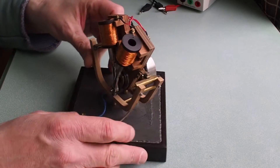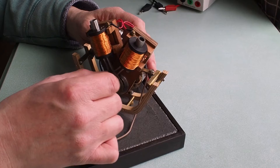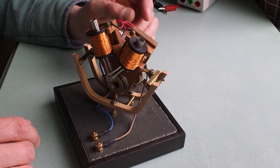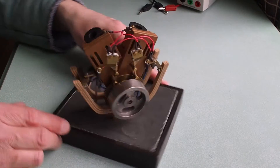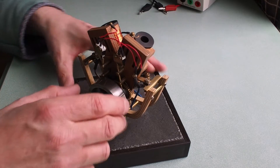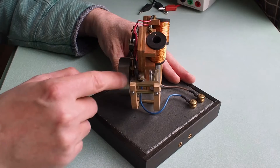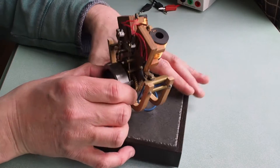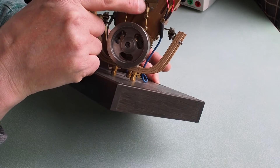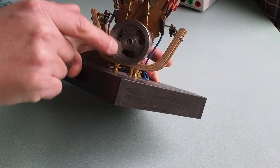With the single pin, what we get is a firing of one solenoid, then the second solenoid, and then nothing for a while — so it's a bit of a hit-and-miss, just like a Harley-Davidson. These cams operate little push rods, and those push rods operate little micro switches with tiny metal springs that push and operate the switches.